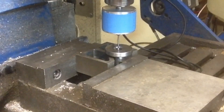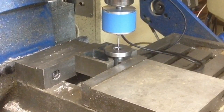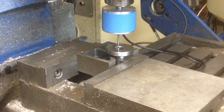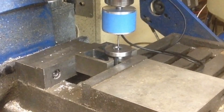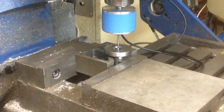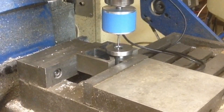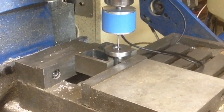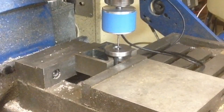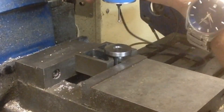Okay, we're just going to probe for the center of our hole — that's all we're doing. So we've got it set up. That should be the center of our hole right there. Let's go ahead and zero out our digital readouts. Let's go ahead and probe that one more time just because we can, see if it gives us the same numbers. So we'll zero those. Now the rest of this I'm just going to work off my digital readout.